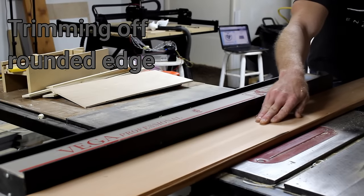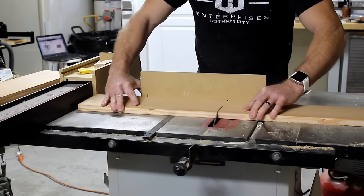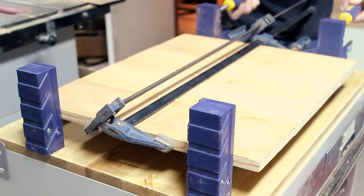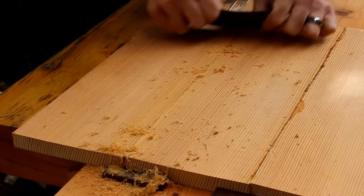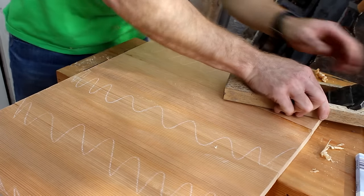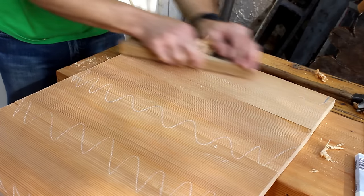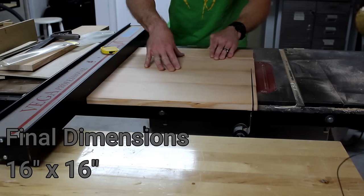This project is made from some straight grain Douglas fir. The 5-inch boards were cross cut to 17 inches. I cleaned up those glue lines with a card scraper. Of course I have to make this bigger than the planer I have, so to flatten the boards I marked the high points with chalk and hand-planed it flat. The uneven end grain side was trued up before it was cut to 16 inches.